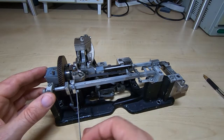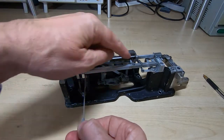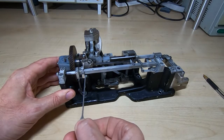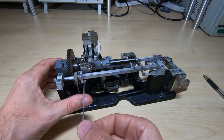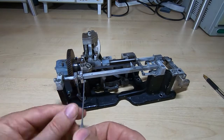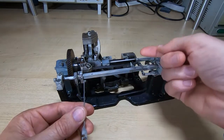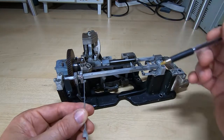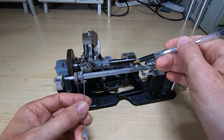The solenoid is connected to the end of this lever, so if I pull and push this lever you'll see this shaft rocking up and down. It doesn't move very far. As the solenoid receives a 1, it pulls this lever forward, pushing this lever in this direction, and that causes this thin plate to rise and line up with this small pin. When the solenoid moves the other way, it pulls this down and the flat plate is below the pin.